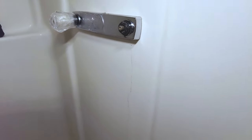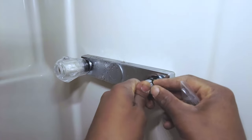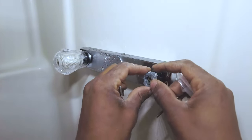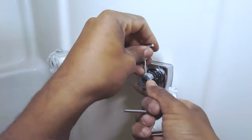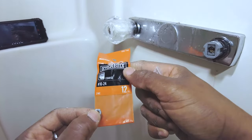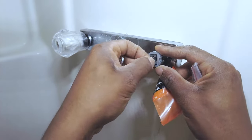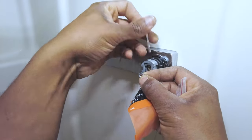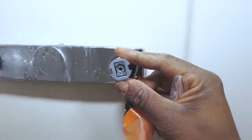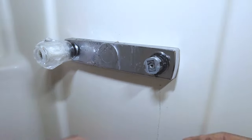So what I did on this side here - I went ahead and got my Allen key to loosen that up. So you fix this underneath here. Check out how simple this is. You grab some coarse-threaded nuts - I guess that's number 10 through 24 size. So it's this here, and I'll just go ahead and loosen it up, and this will fit right in here. See, that fits right in there perfectly, with just enough play so that when I tighten this down, it tightens both of them perfectly.